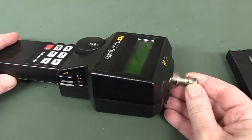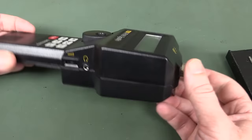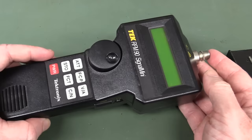The whole idea is that you go to somebody's house with this and they've got TV problems. You plug it in to the antenna - you might even go up on the roof and plug it in directly so you get as little cable losses as possible. You tune in the channels you want and it will tell you the RF signal strength. There would be standards for minimum signal strength required to get reasonable footage. But it's all changed now - this was back in the old analogue days. And it's got headphones - it decodes the audio, you can probably listen to it.